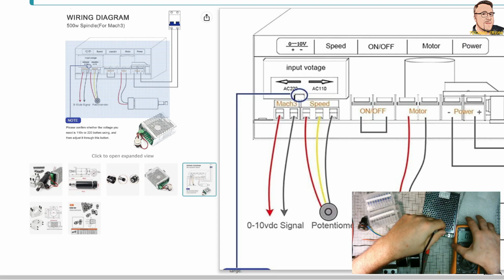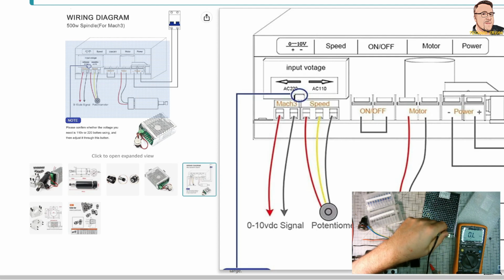As you can see, we've got 2 pins for power input, 2 for motor output, and 2 for on-off. No ground connection. That's the problem I need to resolve. Never connect the main powered device without the grounding case, because that's the metal body which could easily, for any reason, go live and will kill you.